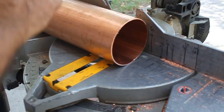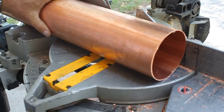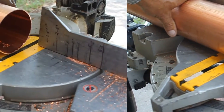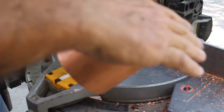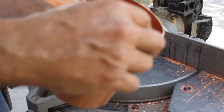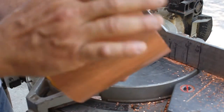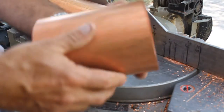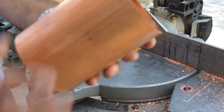The next piece is going to be the body — this section is five and a half inches. We slide this to the five-and-a-half-inch mark on the chop saw, make the cut, and we'll have the body section ready for fabrication. This chop saw cuts these perfectly at 90 degrees, which is what you want based on the ferrules we've had fabricated. The CNC machine has actually cut a shoulder on that ferrule — I'll show that to you before we get going. It's imperative that you use something that makes these cuts 90 degrees.